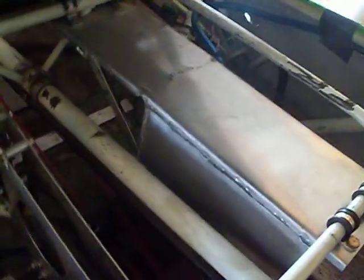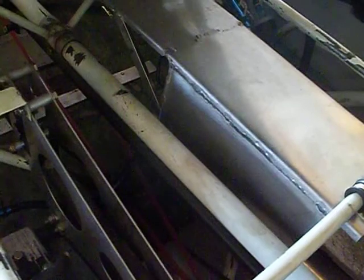Now come around, in this aircraft we have our installation here, we draw off the tanks directly as opposed to feeding them into the main tanks. Now I don't know if you can see the lighting here, it's rather poor, but there's a header tank. This header tank supplies the engine. There's valves here that we use to select. We can either turn the header tank on or off.